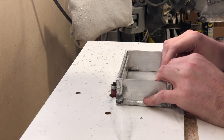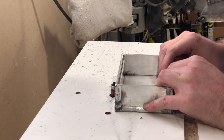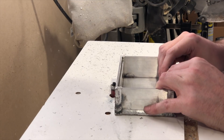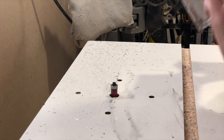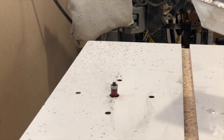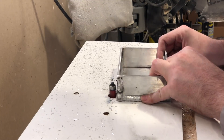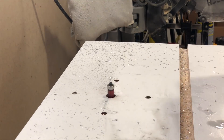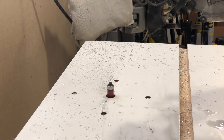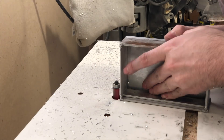For this next step, I hop back over to the router table. This is where I'll cut off all the excess aluminum. I'm using a simple flush trim bit. This bit is used to trim veneers and laminate glued onto wood. The bearing on the top will keep the teeth from cutting into the part, just removing anything that is sticking out from the sides. Even though a router isn't designed to cut aluminum, it seems to make quick work of it, and with only a few minutes I have a perfectly square box.